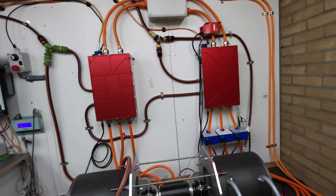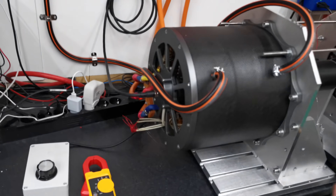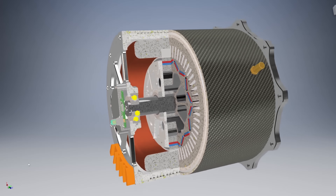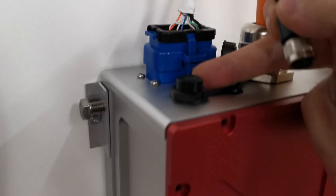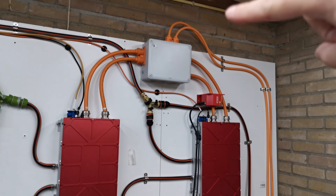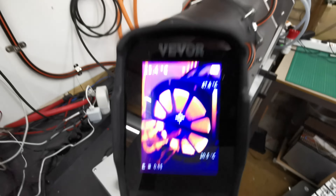This is the setup using VESC software. The controllers can both run in sensorless mode or resolver mode — this motor has a resolver in the back so it can accept resolver signals, or a custom encoder. The inputs include a CAN adapter and USB for firmware update. The two controllers are on the same DC bus, and you can see the battery voltage coming in, accounting for the efficiency difference from the battery.